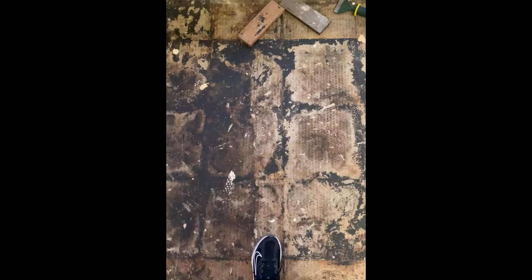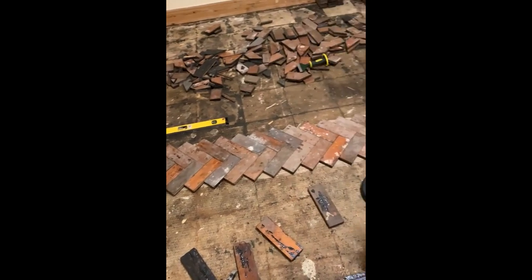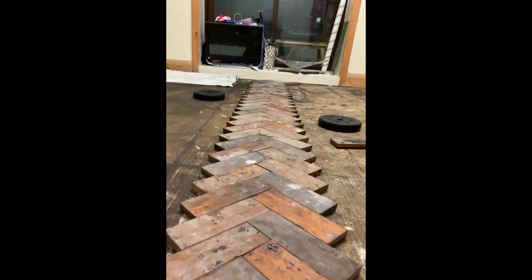Still, I'm talking £360 total — that's with the adhesive and the wood — whereas it would have been £400 just for hardwood flooring without any adhesive or underlay. After googling, we discovered that the best way to ensure straight parquet flooring is to start in the center of the room and work your way back, going outwards, so that when you hit the wall the chances of being straight are high.